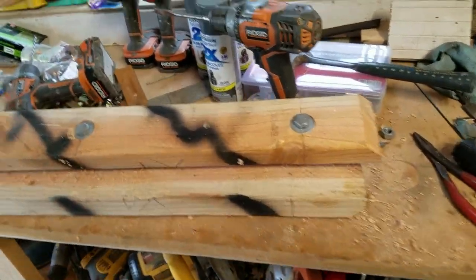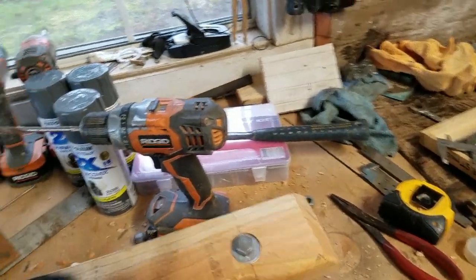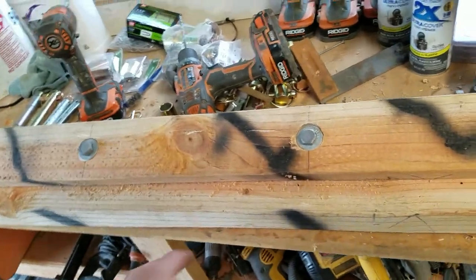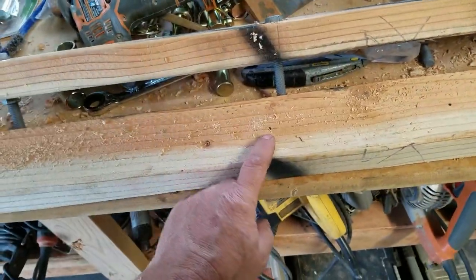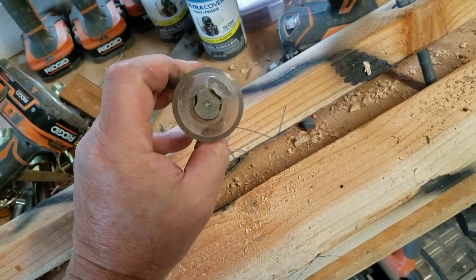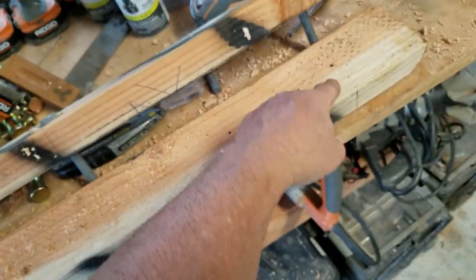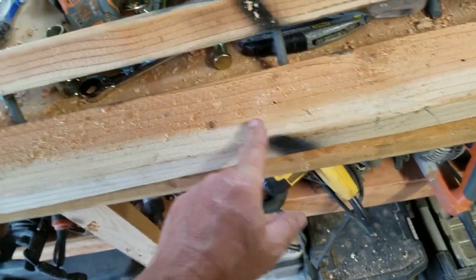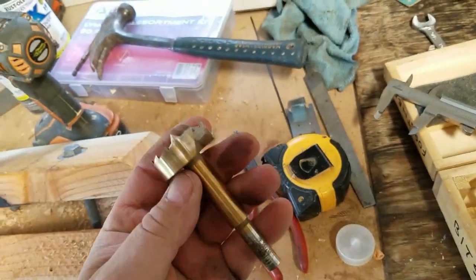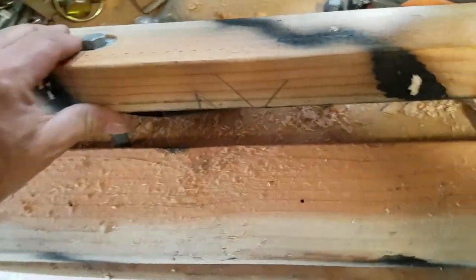What I did is I took two four-foot two-by-fours, screwed them together here and here — just put two screws in all the way through so they're straight. I use a little bird's nest here to make sure you go through straight. The drill goes in through there. Drill the straight holes through, then I counterbored these out — I think it was a one-and-three-eighths Forstner bit — and sunk them in a little bit to keep them straight.